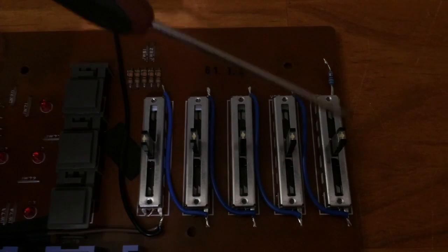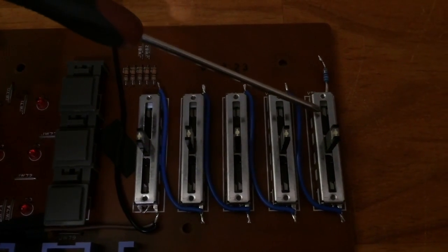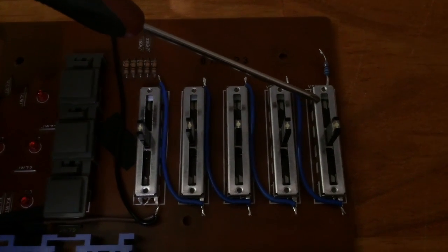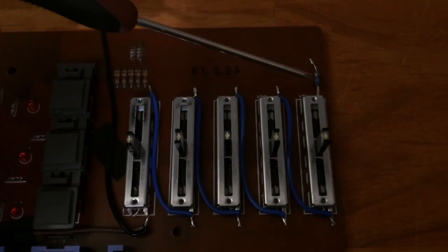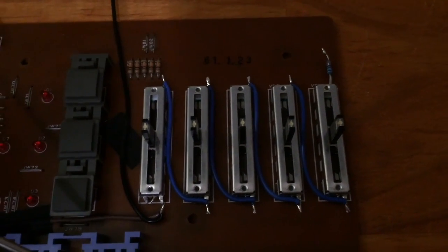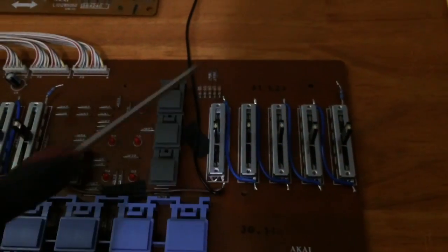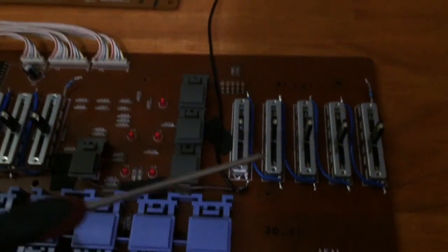If we just put one LED, that LED would only maybe take 2.5 volts from that whole 15 volts, and we'd have to drop 12.5 volts across this resistor and it'd get too hot. So that's not going to work. So the only way to make this work is to start grouping them together in series.